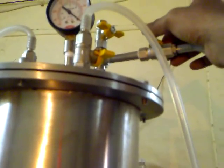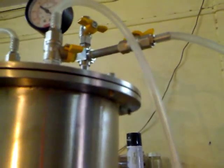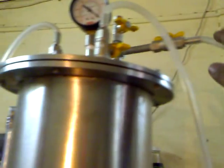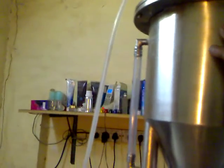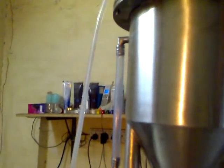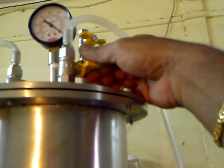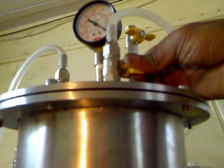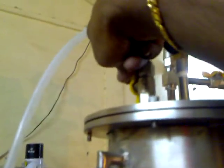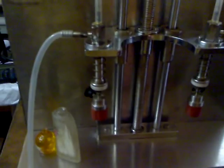The suction line has to be opened by rotating anti-clockwise. The vacuum from the pump enters the vessel and is then ready to suck the material from the bottom vessel. As per filling required, the operator has to open the valves — right or left — to fill from the first or second nozzle.